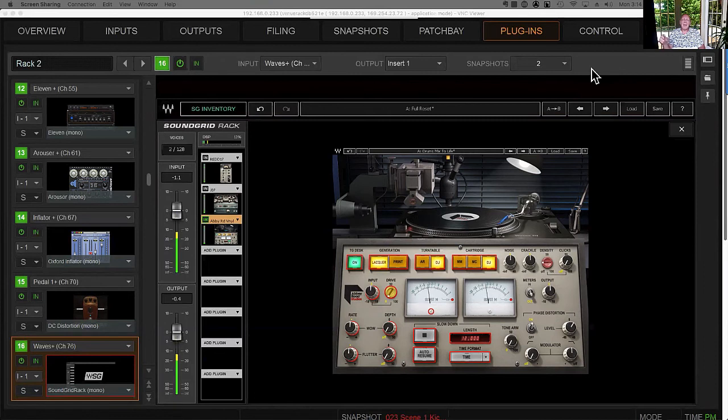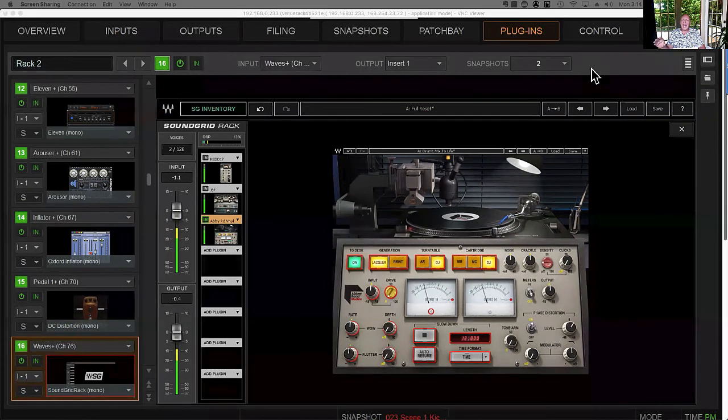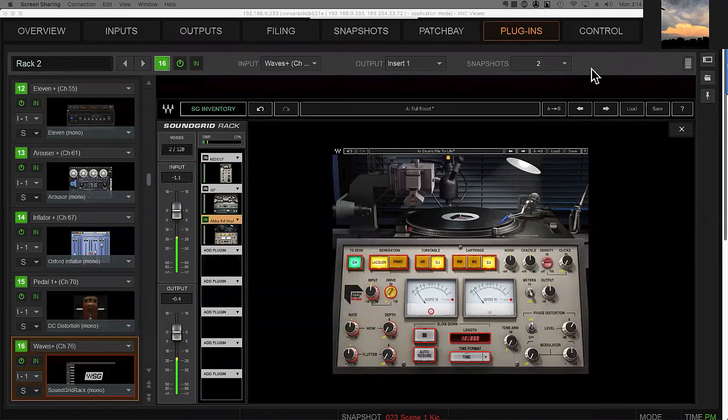I think the Smaart side of your demonstration here was a fantastic way of showing exactly how the harmonics show up in amplitude, and then by switching to the phase trace, actually what effect it's having on the tonal characteristic of the input without actually going to EQ. I think that's a big thing right there. It's hard to explain to somebody, even somebody relatively new to this, that yes, you just heard it get brighter, but it wasn't equalization that did it.